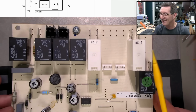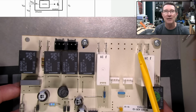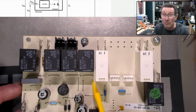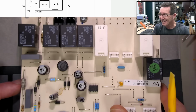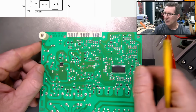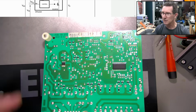Seriously, in appliance manufacture like this, even your $10,000 plasma TV, you'll still find a single-sided power supply board, for example. And none of that FR4 rubbish, right? Phenolic base, because they saved a dollar on the board or whatever. So anyway, I'm greatly doubting that replacing that cap will fix it. Anyway, let's suck it and see.